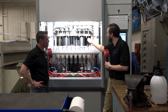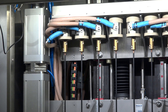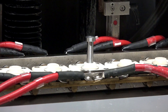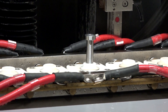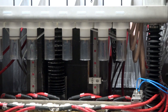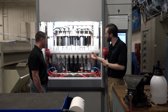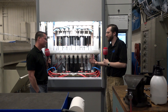We've got cathodes up here. We're standing in front of a CI2500. This one in particular is a rifling machine — we have eight pistol barrels lined up side by side and we rifle these pistol barrels with eight cathodes. Each cathode is individually controlled, and what the cathode is, is really an electron source.